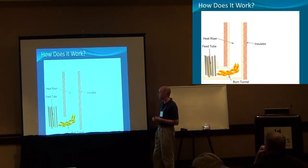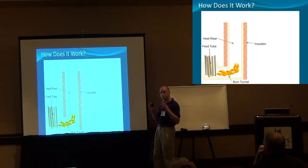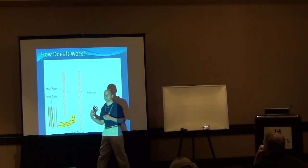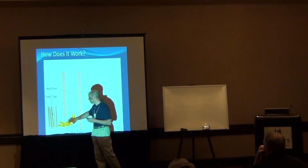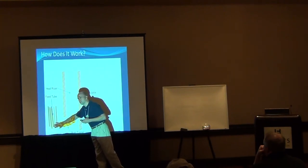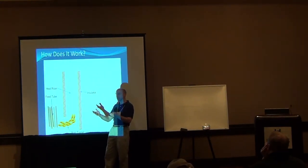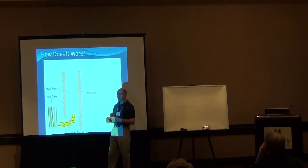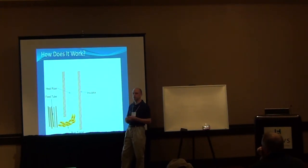The next relatively important part is you want to insulate your heat riser. The goal is to keep this combustion area as hot as possible. What starts to happen is the wood heats up and essentially starts gasifying — it releases gases from inside. You have some coals burning away, heating the wood, which forces the wood to emit its gas, and then you get combustion. By putting insulation around that heat riser, it keeps getting hotter and hotter, giving you a chance to burn secondary gases as well.